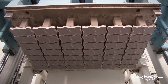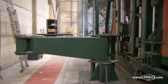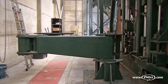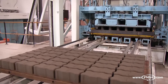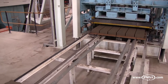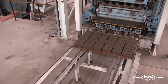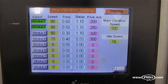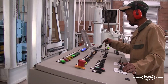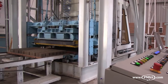The moulds on the RE1400 can swiftly and effortlessly be changed using the mould changing arm, ensuring speedy turnaround times when switching between the manufacture of hollow bricks, pavers, retaining wall and decking blocks, concrete curb stones, and building bricks. While the machine is in operation, machine parameters can be changed using a touch screen interface on the control desk. This allows instant adaptation to changing moisture content and aggregate consistency without having to stop production.